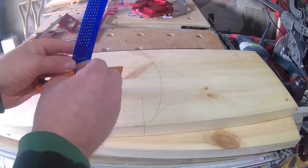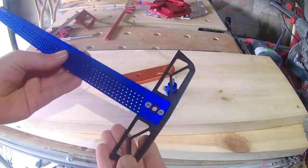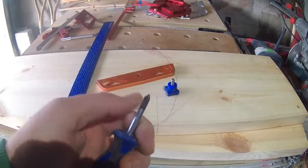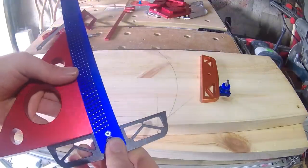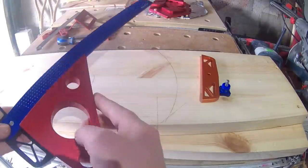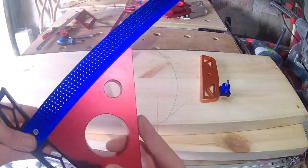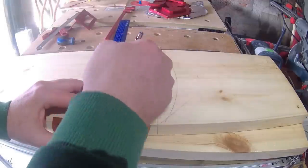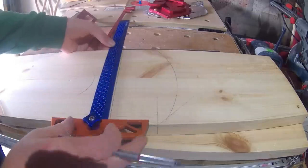The important thing is square, and when this arrived it wasn't. But fear not — if you get one yourself and find it needs adjusting, you can unscrew the nicely machined alloy thumbscrew and take off the orange top piece to reveal two small setting screws underneath. Worth saying: to save you mashing the small and seemingly soft setting screws, I found a PH2 bit size to be a good fit. Just undo the screws a little so they still bite but allow some movement, rest against a square you know to be good, then do the screws back up good and tight. Mine is now nice and square.